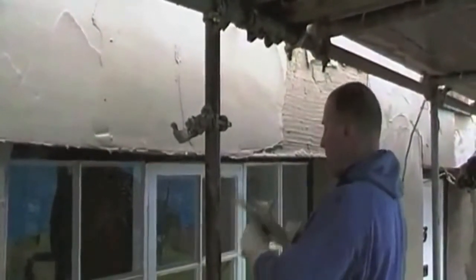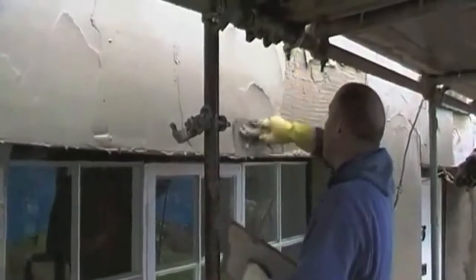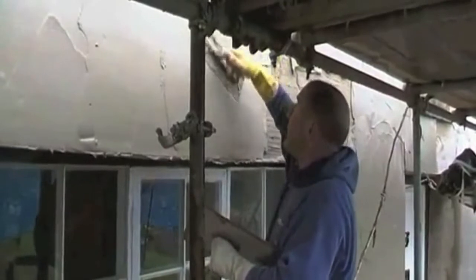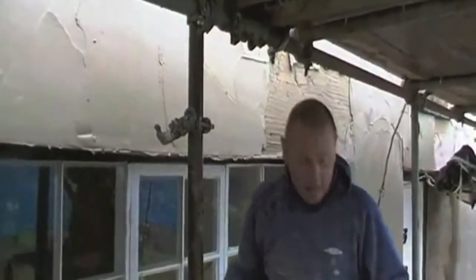So now we're at phase two. What exactly are you doing right now on top of the first scratch coat? I'm laying on a waterproof coat for the surface now, which will be leveled out, floated up with a plastic float and then sponged off with a sponge and it's finished, like you'll see on the gable end in a minute.